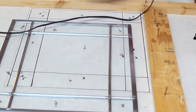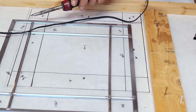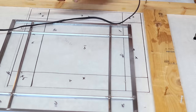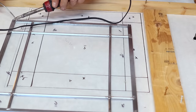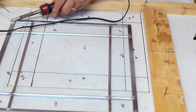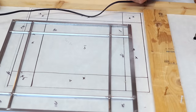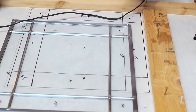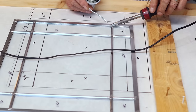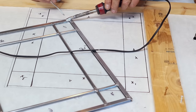Sometimes when you have many solder joints you can work almost too fast and your iron will get very cold. So if you're going to work fast — which I prefer to do — turn your iron up a little bit hotter and you'll be able to work faster because your iron is going to stay hotter longer. That little bit of extra flux isn't going to affect you.